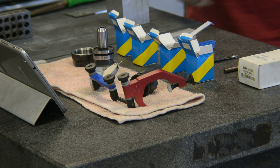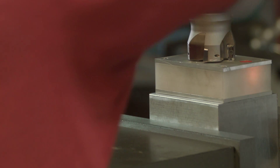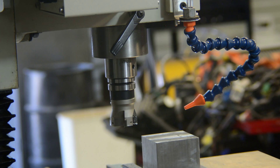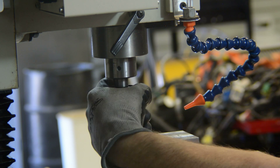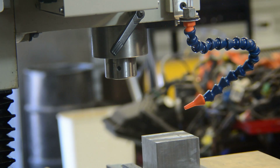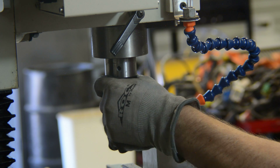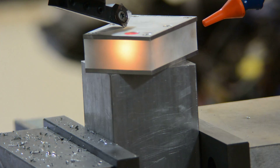Once the part is clamped in the vise, you need to choose the correct cutting tool. I chose a face mill for this roughing pass. Next we run a finish pass with the Tormach superfly cutter, which makes for a very fine finish. Machining every face on the block is a must — the shape of the raw stock is often wavy and causes issues with accuracy.